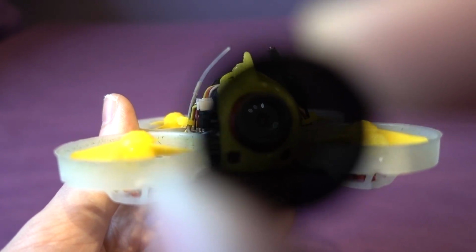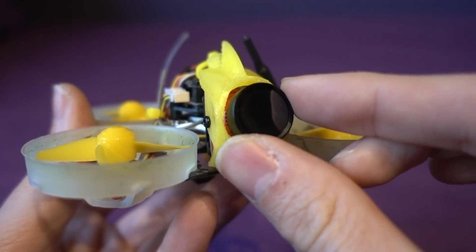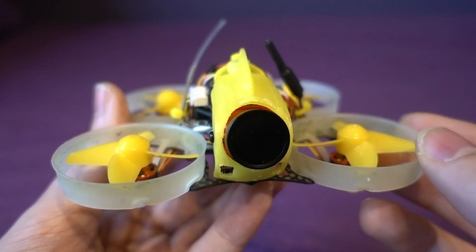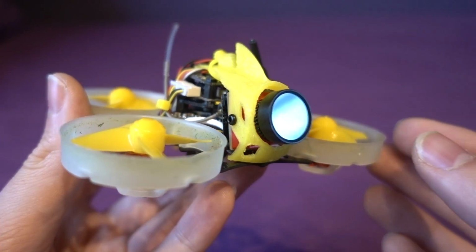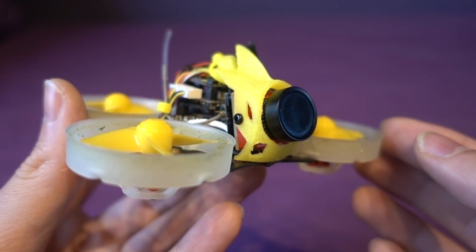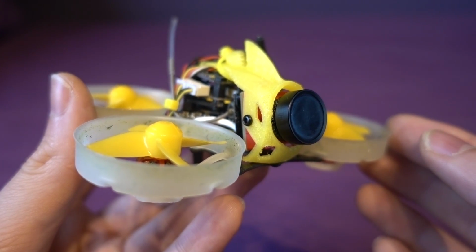And why is this important with a CMOS camera? Well, it's all to do with how fast the rolling shutter is opening and closing. Now, on some of these cameras you can set a manual shutter speed, but if you set them to auto, then the camera's software will alter the speed of the shutter depending on how much light it receives. So if a lot of light is hitting the sensor, then it will speed up the shutter, which means the image becomes sharper. And with that sharper image, you can see these rolling shutter distortions more clearly.